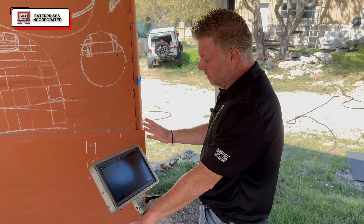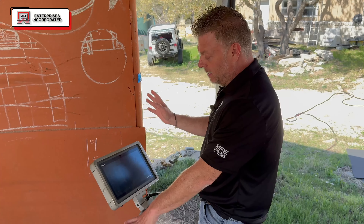Now what we're going to do — I'm up against the plate or the shell in the critical zone. I'm going to start scanning and as I go forward, it's going to record that data. I know right there, there's a defect that I just went over and that's giving me that exact location.